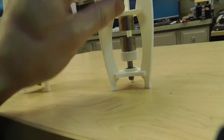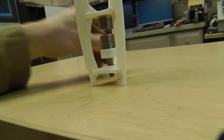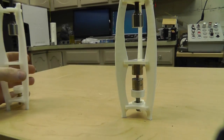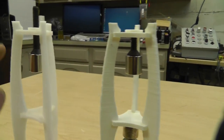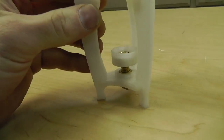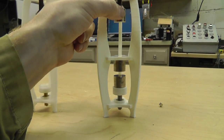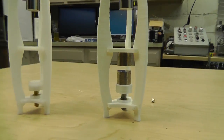This is a 3/16 inch square magnet. I got to move this one away — it's really sensitive. Get everything squared away here and it'll just continue to float in there. If I get this one close it really messes that one up — look at that leaning. This has a different bolt here; you really can do either or. I'm probably going to get a little bit longer bolts and maybe get something shiny. I did use brass on all of the parts because you don't want it magnetic. The reason I really like this is because you can actually adjust the base and the top magnet, so if you wanted to play with different styles of magnets, this allows you to do that.